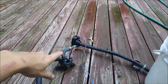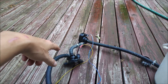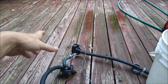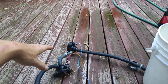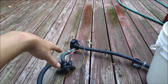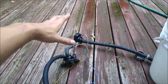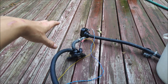Alright, so it took 53 seconds to empty the whole bucket with two pumps connected in series. Taking 19 divided by 53 times 60 gives 21.5 liters per minute — that's roughly 32% more flow with two pumps connected in series. Next, I'm going to connect them in parallel. I don't think they're going to flow as well as this, but I might be wrong — only one way to find out.